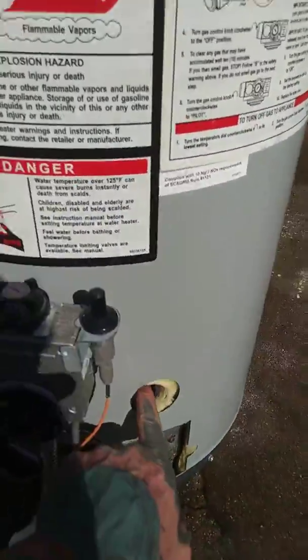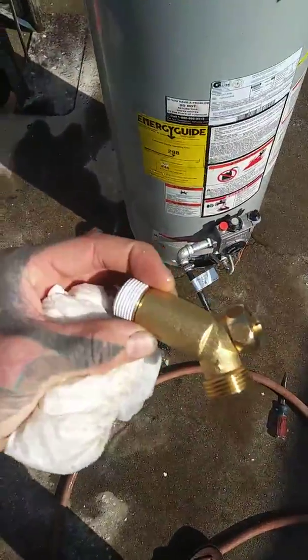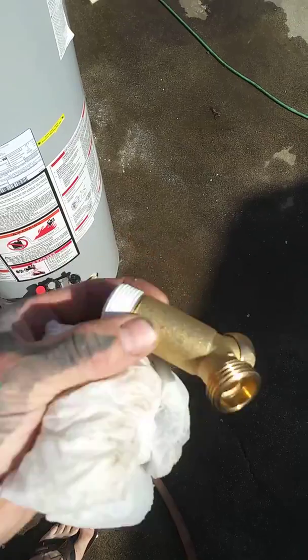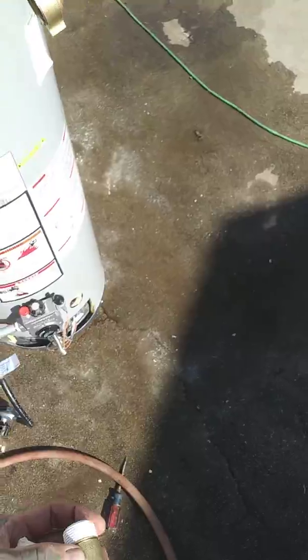This is your little drain hole — this is the drain screw that goes right here. Basically this is what it looks like. This one is brand new; the other one was plastic. With the drain screw, you can only open it so much and that stuff will come out, but it has a blockage piece in there that doesn't allow the flow to go out fast enough to push that stuff out.